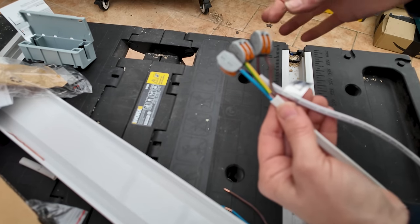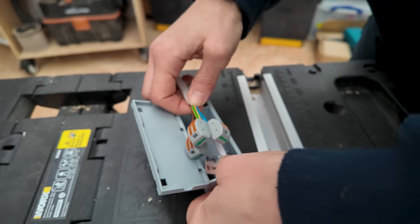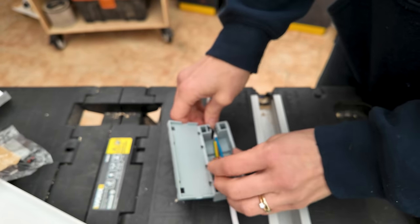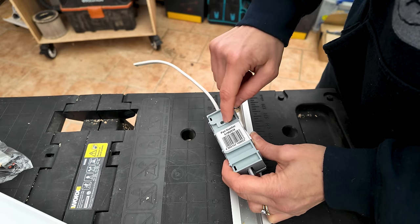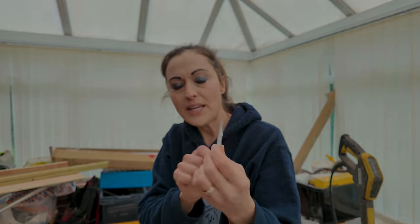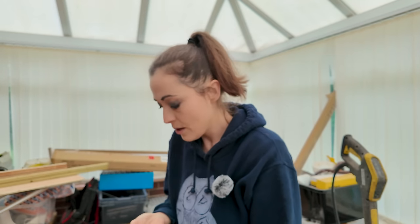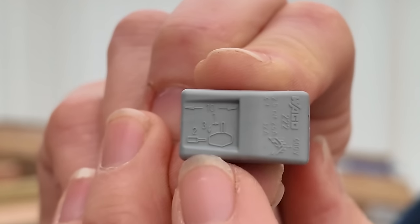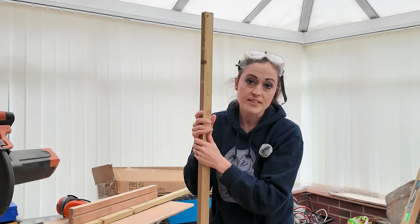If I want to add another light I'll use a three-port Wago instead of two. To make sure everything is safe, I put all those connectors in a Wago lighting box — slot the cable in one end and another one at the other end, close it, then mount it to the wall with the little screw at the back. If you're new to Wago, there's a picture of the instructions inside the box with cutting and stripping tips, and the back of each connector has a cutting guide showing how much to strip and the amp ratings.